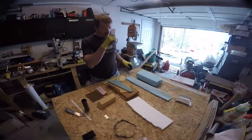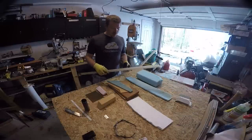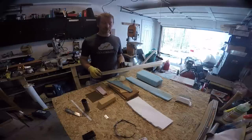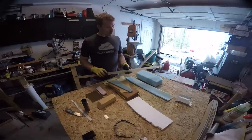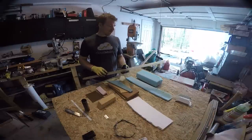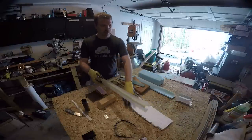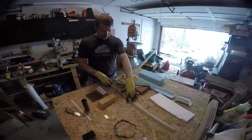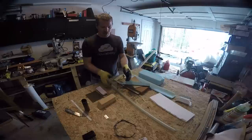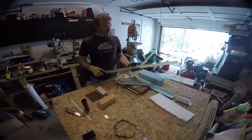First, I have a couple of pieces of fiberglass that I laid up without any foam core — just utility pieces I made for different projects. I did use a core for each one but it wasn't foam. This one here I laid up over a sheet of metallic conduit — EMT, half-inch — and I just laid the fiberglass up and over the edges on my workbench on a piece of plastic, a little oversized, and when I was done it comes right off the plastic and you cut it to shape.